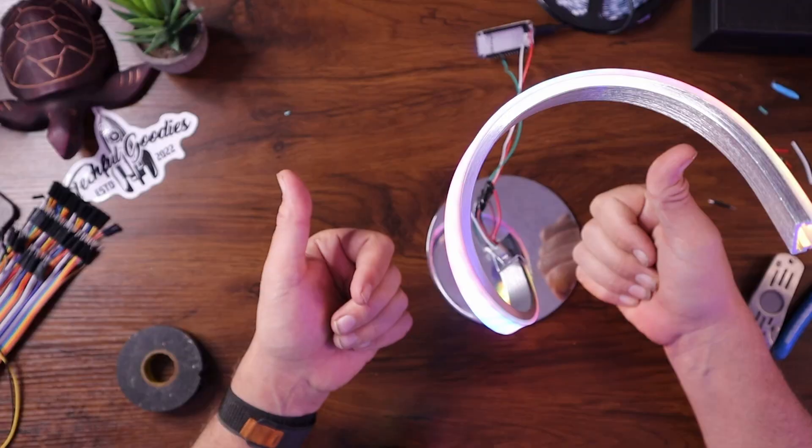So now I've got an upgraded lamp. All I did was take an old lamp, put in new addressable LEDs, hook up a controller with WLED, and power it by USB so when my computer turns on it turns on and saves the last settings — basically hands off. If you have any questions leave them in the comments. If you liked it give me a thumbs up and hit subscribe. Until next time, this is Carl from Techville Goodies.